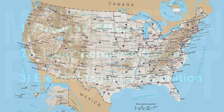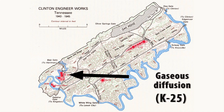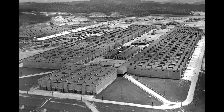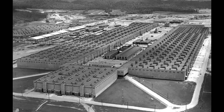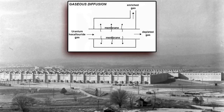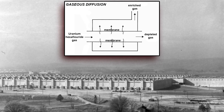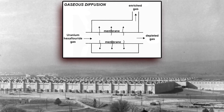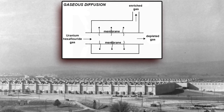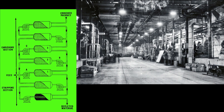The work was done at a gigantic facility constructed at Oak Ridge, Tennessee. The gaseous diffusion plant was here — K-25. It was the biggest building in the world up to that time, a half-mile long and four stories high, and the greatest single expense of the whole Manhattan Project. With the gaseous diffusion process, uranium hexafluoride in gas form was passed through a membrane to filter out uranium-235 atoms, which were ever so slightly smaller than U-238. A single pass through a gaseous diffusion separator didn't do very much — the uranium hexafluoride had to be passed through a whole series of separators, each raising the percentage of U-235 a little bit more. That's why the building was so big — it contained hundreds of these separators.